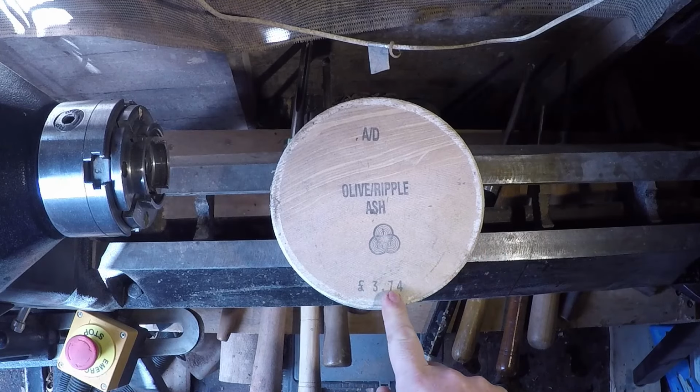Okay, I'm just going to round over that bead a little bit. I'm not going to use sanding sealer on this because I want it to be food safe. Just to bring it out a bit. No point making it super shiny and super blingy for a shelf piece because quite frankly, if it's going to be a functional piece, most of the shine and the sheen will probably disappear quite quickly anyway.